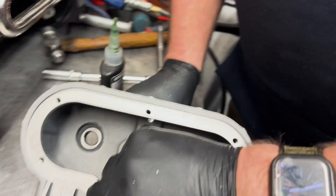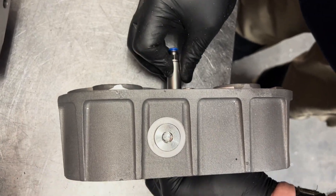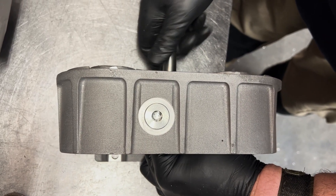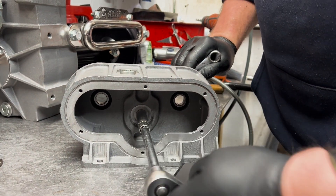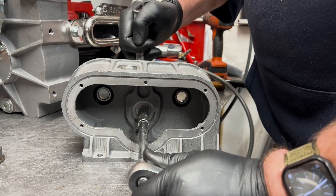Find the nut supplied in the kit — this is what you need to screw onto the air piston on the inside of the top housing. Tighten by hand the nut onto the air piston to avoid cross-threading. Using a half-inch socket on the nut and the 15mm spanner on the air piston, tighten the nut to make a secure fix.